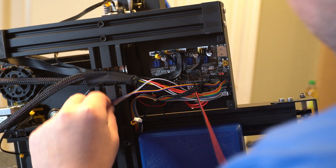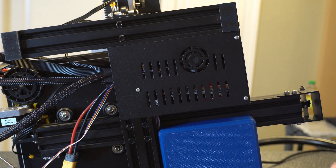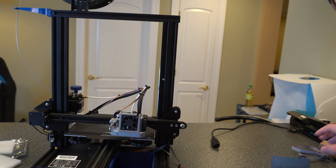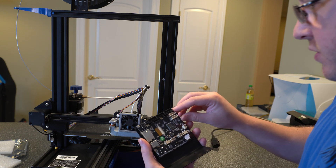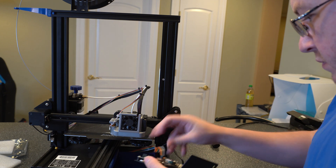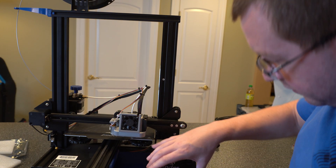Alright, so now let's go ahead and close it back up. I hate trying to put these screws on at these angles but with the recording I kind of need to. Now that those are in we can go ahead and flip the printer back over. I'll change the camera angle and then we'll connect the display. So we should have these two cables — the original ribbon cable and then the serial cable. The ribbon cable is going to connect to EXP 3. The serial cable is going to connect to this RS-232 port. So we're going to connect those up, and that's really all there is to it. Now we will go ahead and remount this, so we just got to grab our screws again and make sure they're in there good and tight and keep the screen straight.